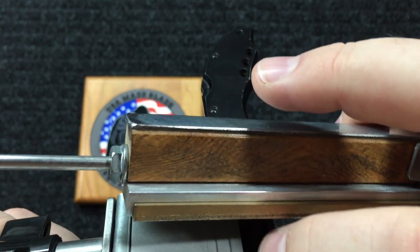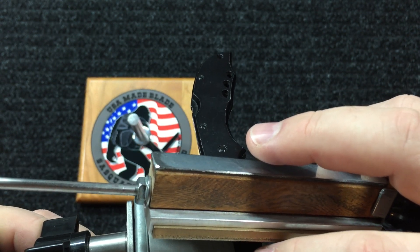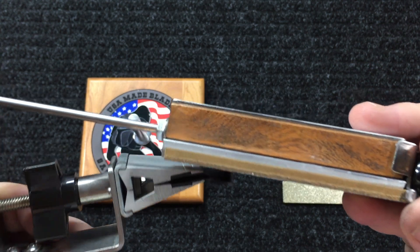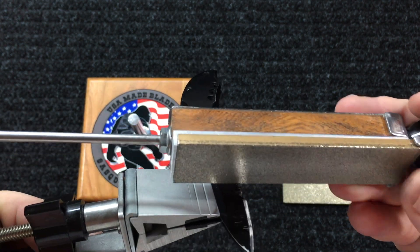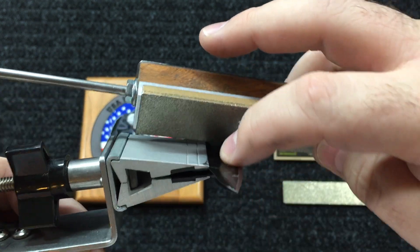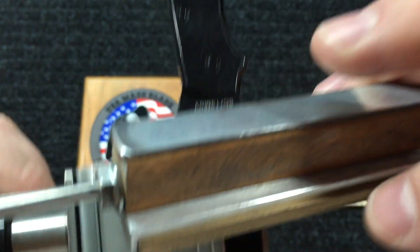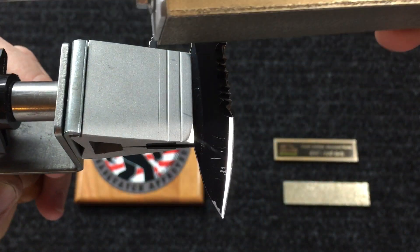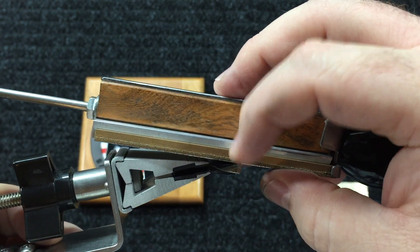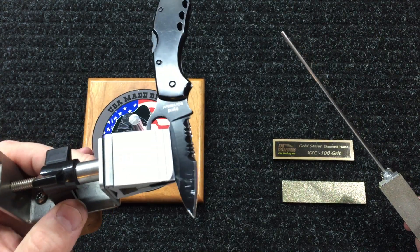As you're going up and down, those little rocks are pooling up there. I'll also explain why I sharpen dry only — I don't use oil or water. A long time ago when I started sharpening with the KME, I was getting blades that were scratching, and that was back when I was using oil and water. When you use oil or water, you get slurry mixed in with all the little loose diamond particles, and as you're going up and down those little rocks travel with your stone because they collect underneath it. That's where you get your scratch pattern on the blade. If there's even one little pebble back there going up and down, it's going to scratch your blade.